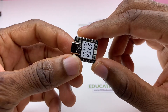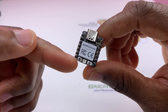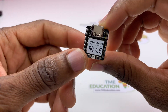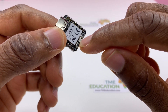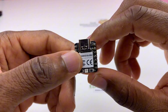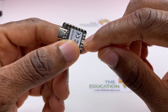On top of this board is the Xiao RP2040 with an RGB LED between the reset button and the boot button. To power this RGB LED, we need to set pin 11 to high. Pin 11 is kind of an enable pin, which is going to enable the RGB LED.